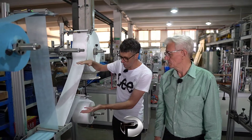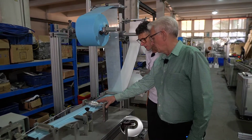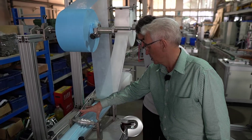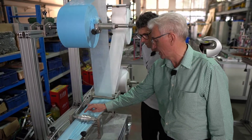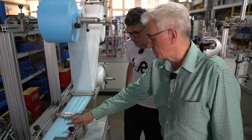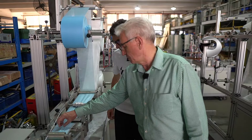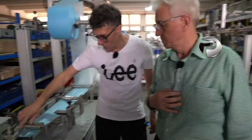After the raw materials are brought together, they go through a fold mold — a mold that does the folding. We need to reduce the width of the mask, so the mold folds the material, and we can adjust the depth to control the width of the mask. After that, a guide ensures the fold is maintained. This is very important because the mask needs to open like a concertina when you're wearing it, so it can go over your chin.